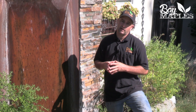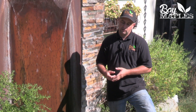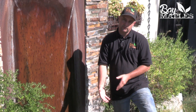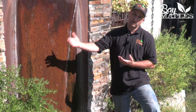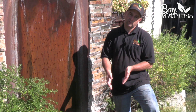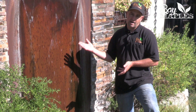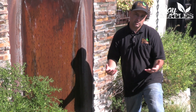One other tip I would recommend to anyone putting in a water feature is incorporating an autofill. This reservoir has a small float switch, and when the level of the reservoir drops below a certain level, the float switch will activate a water fill line which will send water to the reservoir — just enough to keep it full and keep the water feature happy. That way your pump never runs dry and doesn't need to be replaced nearly as often.